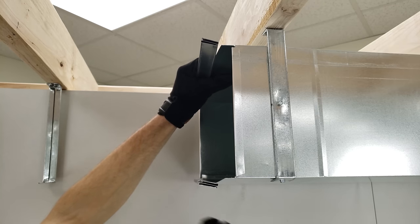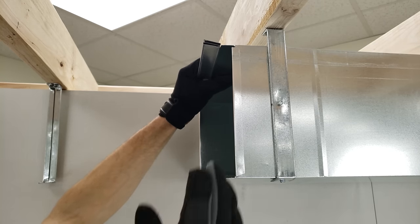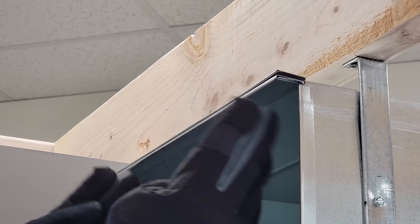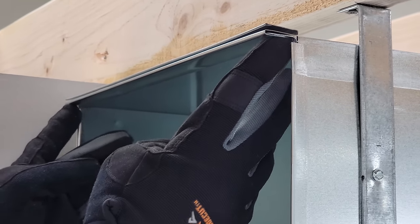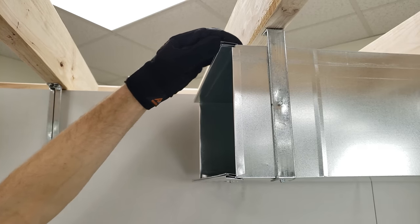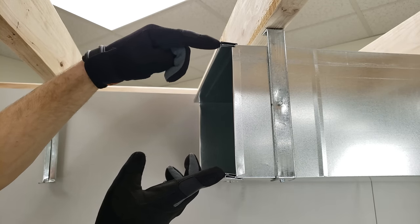So for method one, which is the most common duct hanging method, we're gonna put both of our pieces of S-lock on our existing duct ahead of time. And so these pieces of S-lock, they're also referred to as slip and slide, are cut to about 1/8 inch smaller than the inside dimension of the duct. And you can see that both S-locks are faced in the same direction, so our new duct is gonna be coming right in to the top section right here.